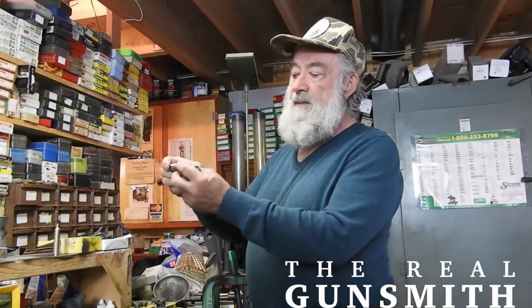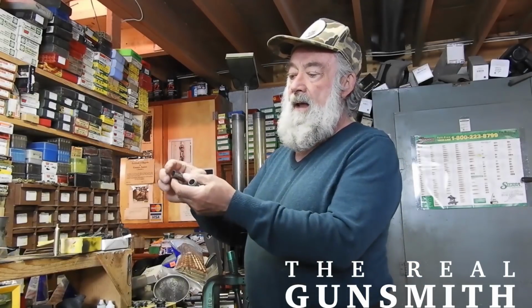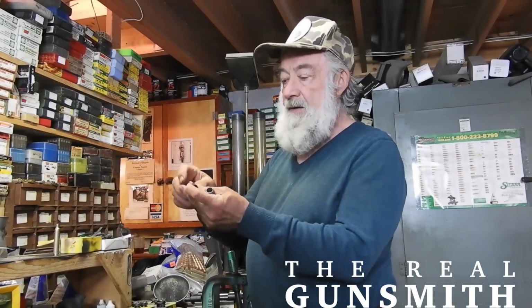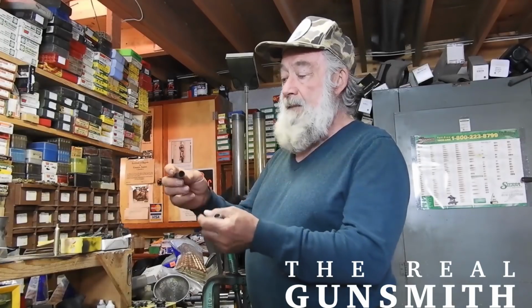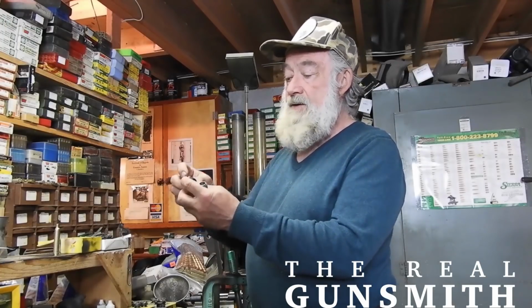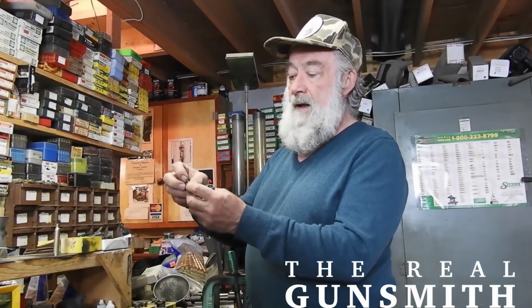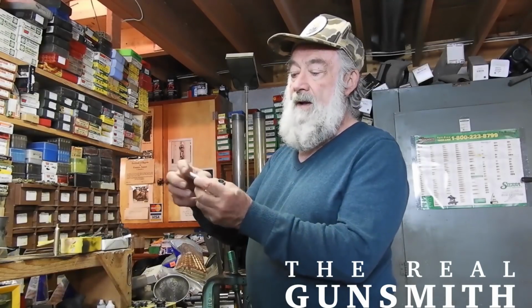This sleeve is split in various places around the sleeve, eight different places, 4 times from one end, 4 times from the other end, and this sleeve is ground to a specific OD diameter, and is ground about 1/2 the length with somewhat of a little bit of a taper.